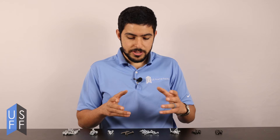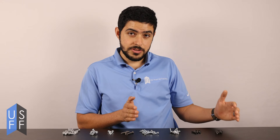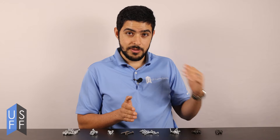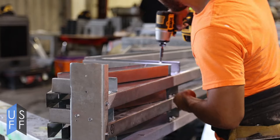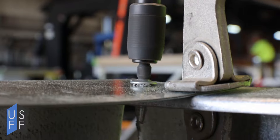When you talk about framing screws, we're going to be looking at this section right here. These are various types of framing screws that you use depending on what kind of metal you're working with and what framing situation you have. By framing we mean attaching pieces of metal together, whether that's light gauge to light gauge, light gauge to heavy gauge, or heavy gauge to heavy gauge.